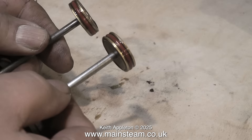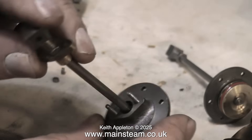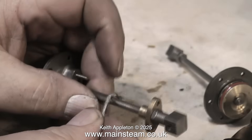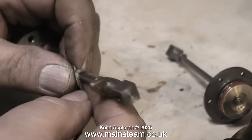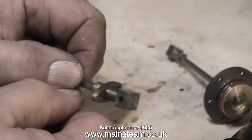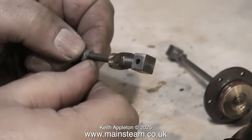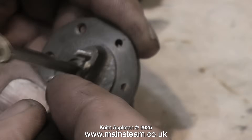When fitting the silicone type, make sure that you fully lubricate the groove before you fit them, and be very careful across the sharp edges. In fact, if you machine the pistons yourself, always take off the inner sharp edges slightly. While the engine is in this dismantled state it's very easy to pack the glands. They weren't packed anyway, so I'm using some graphite yarn to pack the gland. This is some real old-style stuff — I actually unpick some full-size braided yarn because I find the modern stuff not too good. Once it's in, it's in for the duration and you don't get any steam leaks.